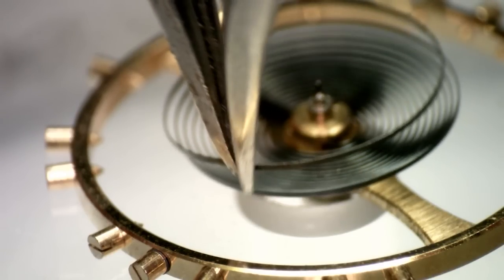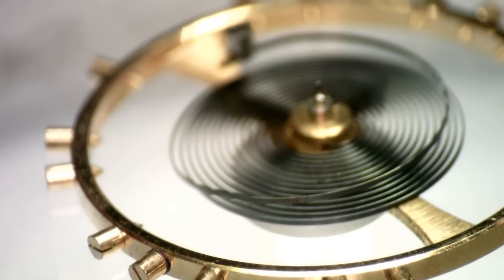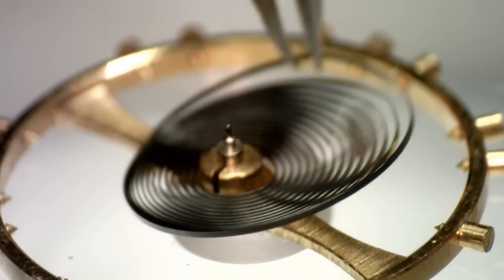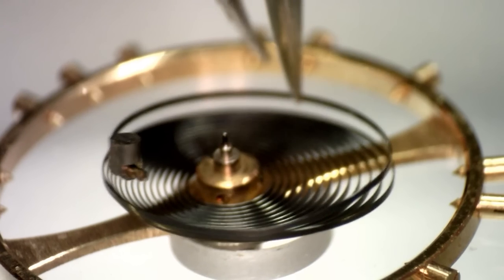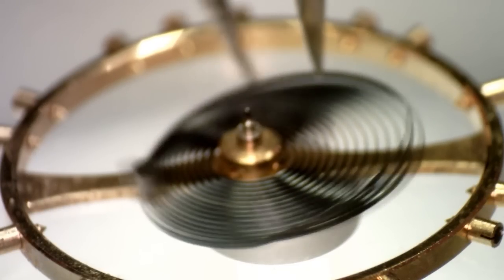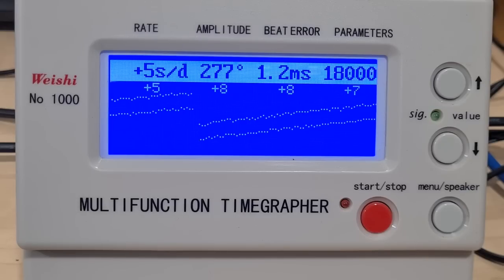So what we're going to have to do is change the overcoil curve a little bit — this is something you really don't want to do too often. It's kind of open heart surgery in a moving truck while jumping out of a plane without the parachute. Additionally, the actual bend in the overcoil was not completely good either, so I also have to try to fix that. But luck favours the brave, and ultimately I did manage to get it pretty good. We're happy with the amplitude; the beat error is ever so slightly high, but that is perfectly fine for this watch.